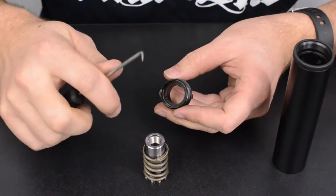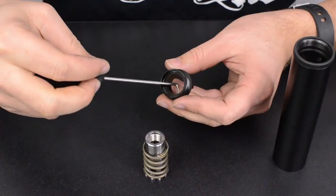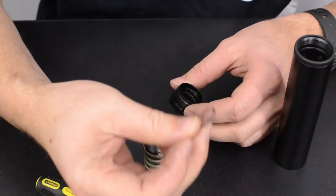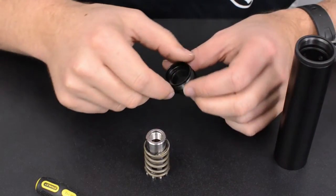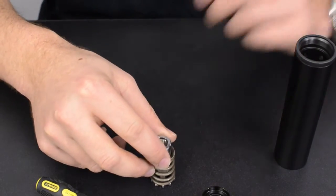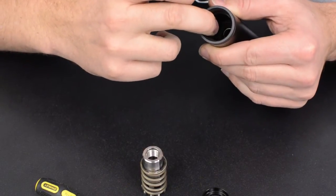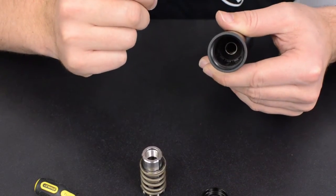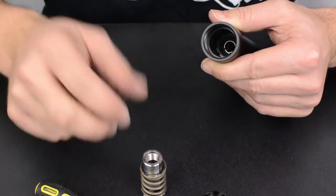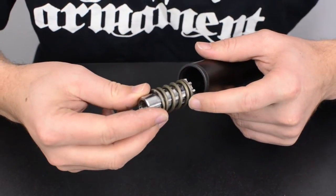Take a small tool like a dental pick, punch it into the O-ring groove, pull the O-ring out, and replace it with a new one. Lube it with something like Vaseline or grease for bolt lugs on a bolt action. Also service the assembly by wire brushing the interior of the piston housing as it gets carboned up, and keep it lubed because the teeth reciprocate and are a close tolerance fit to the booster housing.